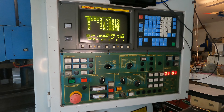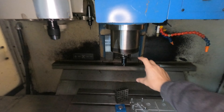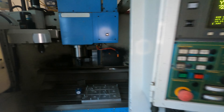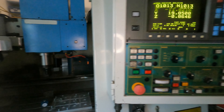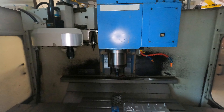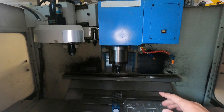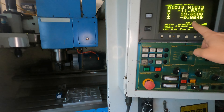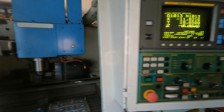I've got a Fanuc OM controller and I would like to measure the tool length of this tool right here, and it's actually not too hard. What I'm going to do is put the machine in handle mode and lower the spindle down, take the tool out first, then lower the spindle down, measure it and get a zero point, then bring it back up, put the tool back in and measure it again. We're going to use the machine relative offset to do the measurement of the tool.